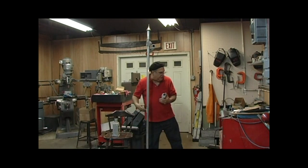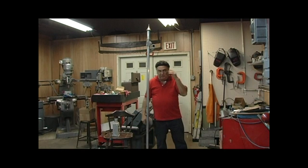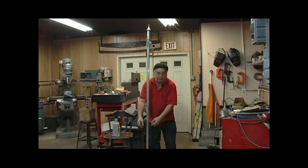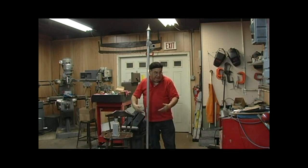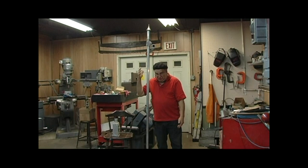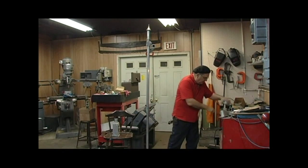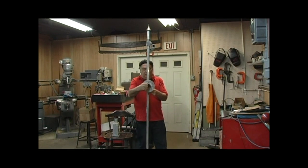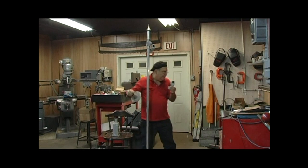Then I have one for grade — I guess if guys run the railroad every day, they gotta know there's a grade there. So those are the three letters that would be on the placard. Then of course I'd have another placard down here with a number on it — 120, whatever the number of that signal is — so they know, and the guy reports back: 'Number 120 signal has something wrong with it.' That's how that works. And then if you wanted to, you could also put a searchlight on here — a single — or put it out to the side, three on the pole.